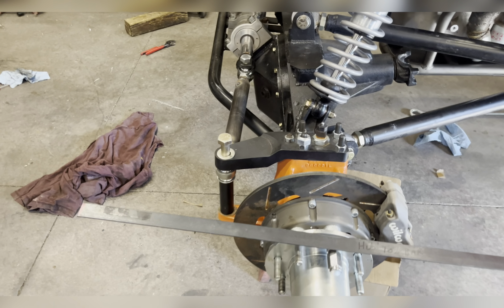I'm going to start working on some steering arms here. First problem with this picture is it's covered in rust because it was sitting outside. Second problem with this, there ain't no hole there, and last I heard, you cannot Bluetooth steering. So I've got to pull these off and drill some 3/4 inch holes. I must say, these are really good arms. They're keyed, they're thick, probably really good steel. We're going to see how they drill now.